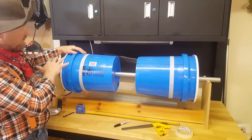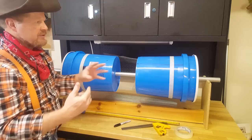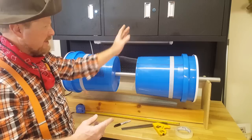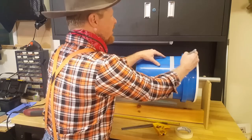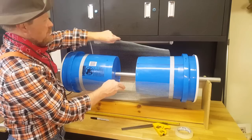I like to look at my trommel in terms of direction of flow — going from left to right, the intake of material on one side and the exit on the other. My motor turns a certain direction and will be mounted on the exit side, rotating clockwise. So I'll go ahead and just mark an arrow on the bucket so you know which way everything is going. That's really key when it comes to putting the screen on.